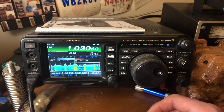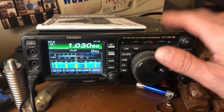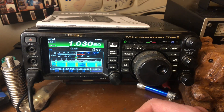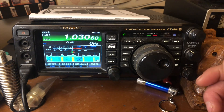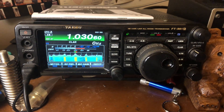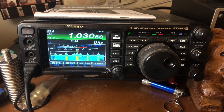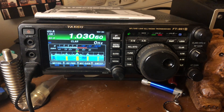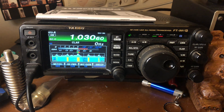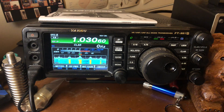Hey guys and gals, Mike from 113. Another thing I do with amateur radio, or at least this radio or any HF radio, is listen to AM broadcast. I have an MFJ 1982 MP medium power 300-watt rated wire outside — it's a 132-foot wire at 20 AWG, so definitely a long wire. You can listen to AM pretty easily.